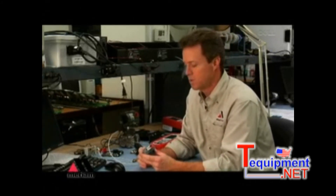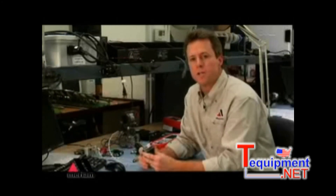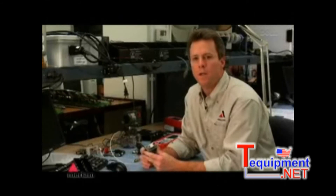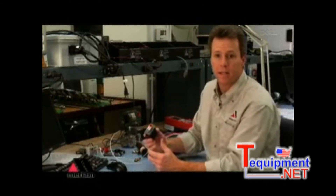That's best in the industry. We have ranges from 10 inches of water column differential all the way up to 3,000 PSIG. We also have a line of absolute pressure modules from about one atmosphere up to 100 PSIA. Again, these can be added at any time for calibration needs as they come up.